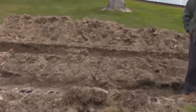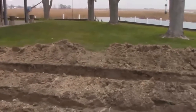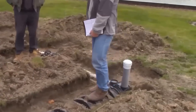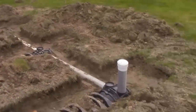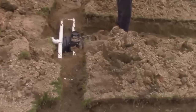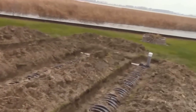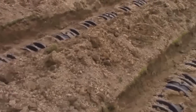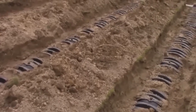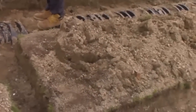As soon as I get the tank and a sump pump, I'm going to fill the tank to see what it looks like. We'll see if the water actually makes it all the way down. It might only be dosing half the system, and then when the time comes it'll find its way to the end. Home pipe wrap over this pipe will keep frost off of it. As long as those holes are such that most of the water can't stand still, it'll naturally drain. We call it a gooseneck — you turn the thing up and point it straight up, then come up and go down; it makes an air break. When the pump turns off, the water drains back that way — instead of putting a check valve, use a weep hole or something like that.